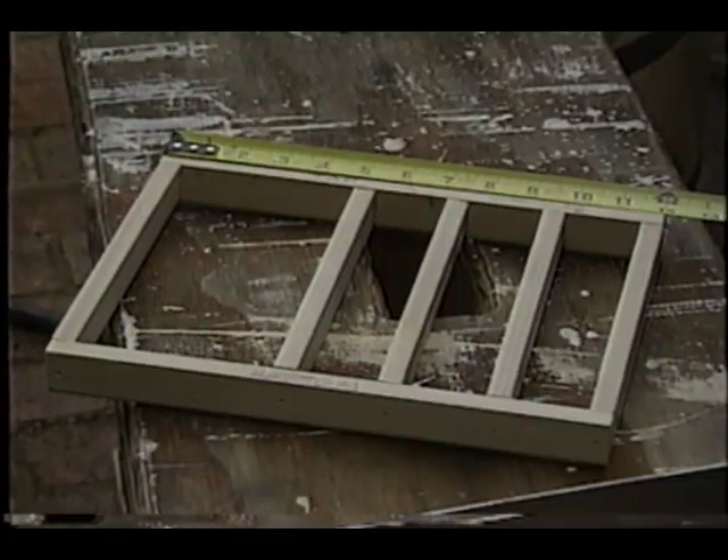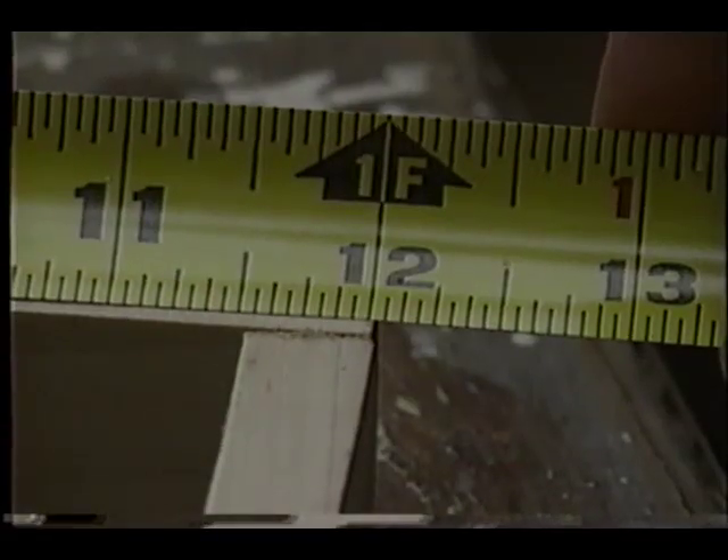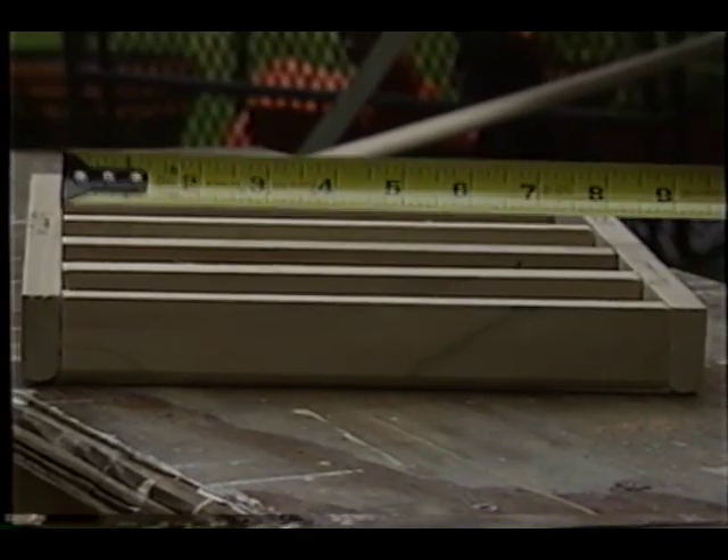How do you do that on a big scale? Forget about all the formulas — you don't need to know all that complicated math. Here's the easy way: simply make sure that the bottom plate or the top plate of any of the walls you're building are the same length. Make sure that the wall studs are also the same length.